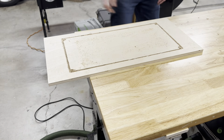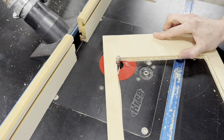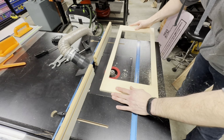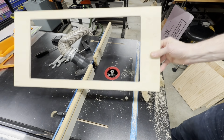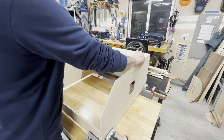Anyway, what I'm doing right now is cutting a hole in the top section of the lid that will have a clear plexiglass panel in it, and I'm going to route in a little rabbet so I can glue that panel in from the bottom. The reason I didn't just put the camera inside the enclosure is that it has to be a certain height above the cutting bed for proper calibration, and I didn't want to make this thing 2 feet tall.